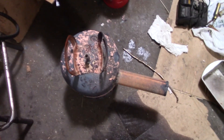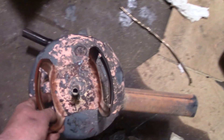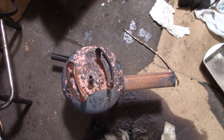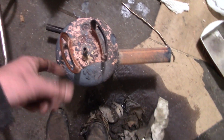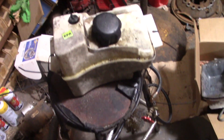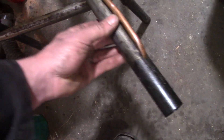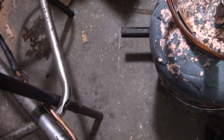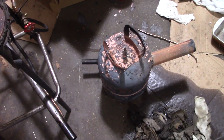I might as well show you my burner. Pretty simple — it's just an old helium tank with a couple of pipes kind of goober-welded on there. Air and oil go in, it burns inside, and the heat comes out. My tank is an old lawnmower tank with some hoses running down to an old faucet, and there's a piece of pipe going into another piece of pipe where the oil goes in. I put a shop vac on the other end and I get fire.